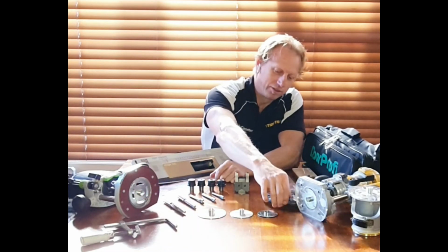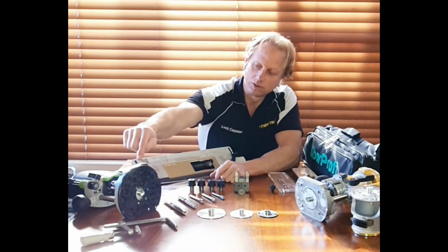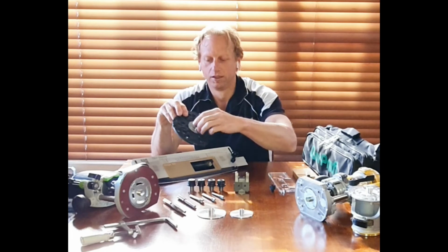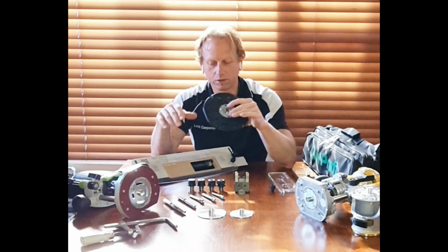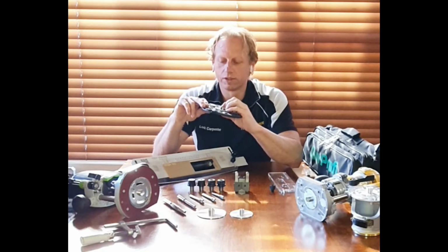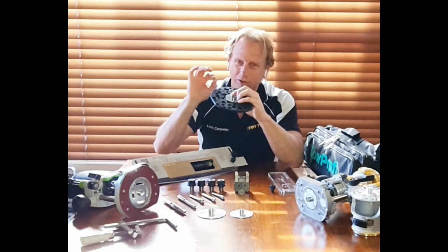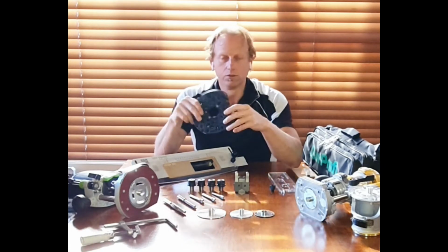If you wanted to work with 16, you'd have to get a universal base plate like that, this is from Trend in the UK. And I've been using this for many years, and it accepts the Trend copy rings. And I've had the whole range from say 10 up to 30 mil in size, because you want to be able to adjust and be able to suit every application. And I've been using different copy rings, and I've been going between 12 mil cutters and 12.7 mil cutters just to make that fine difference. So they're easy to get still.